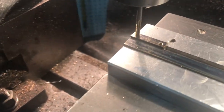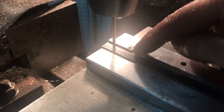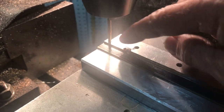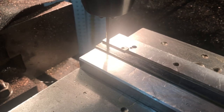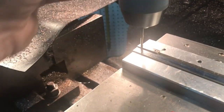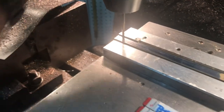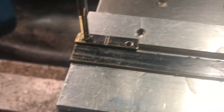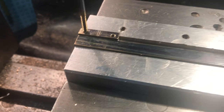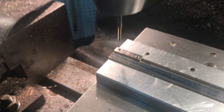Just about done making the nut. I cut the brass like I talked about, then milled it square — quarter inch square — and I've drilled and tapped one of the 5-40 holes, and I'm drilling and tapping the second one now using the bottoming tap. I'll take that out, deburr everything, and then cut it in half and smooth the edges. I know the width of my bandsaw blade so I can mark the cut — it's not a critical measurement anyway.